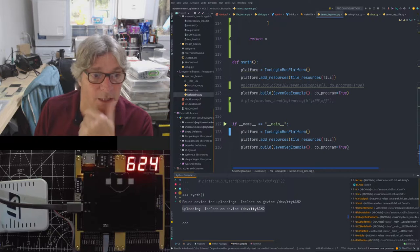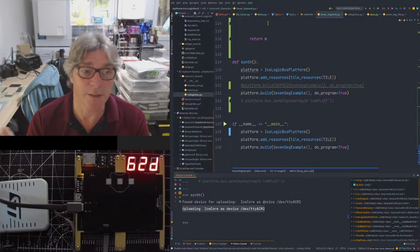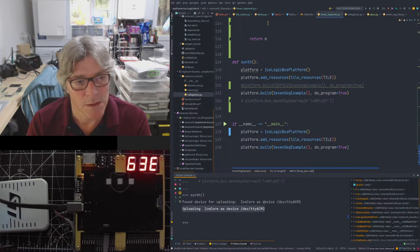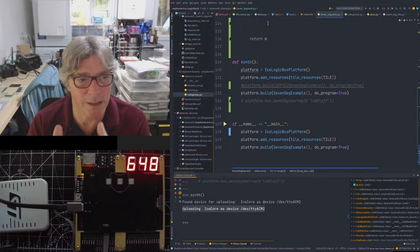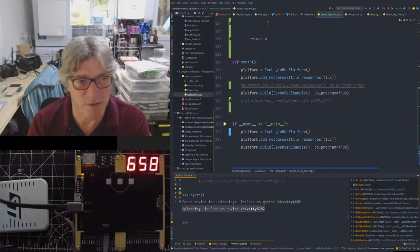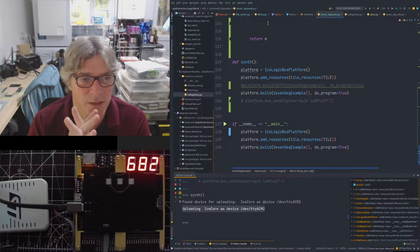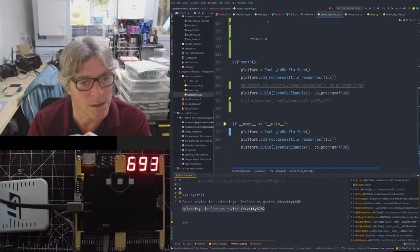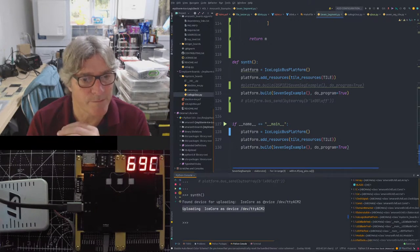Yeah, you know, you'd think that the IceLogic board would be the difficult one, but it's not. That goes together. The one I built today went together perfectly first time. Whereas the two BlackIce Nxt motherboards that I made on Monday both had issues initially. One of which was easy to fix, the other one turned into a nightmare. So it's a bit of a pain, really. It's not my favourite package, TQFPs, not with those 100 pin TQFPs. Because statistically, you are likely to get a bridge that you're going to have to clear up, even with a good reflow process.